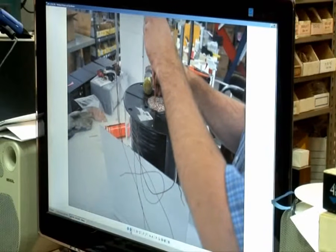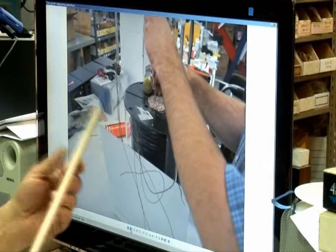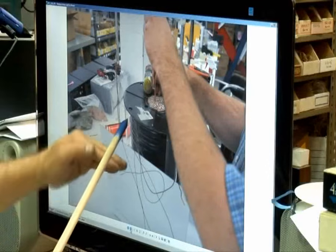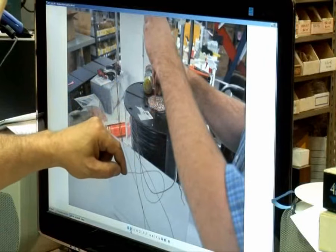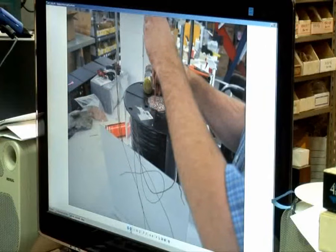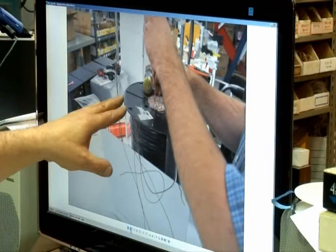In this position in tuning, the magnetic field's going to jump. It's not going to swing. It's going to try to just curve over like this. When you bend these down, the magnetic field's going to swing out bigger, because what we want to do is force the zero out of the center. We want a neutral point real big in the center, so that there's no conduction when the magnet comes across, because we're going to use the impulse technology that we talked all along about